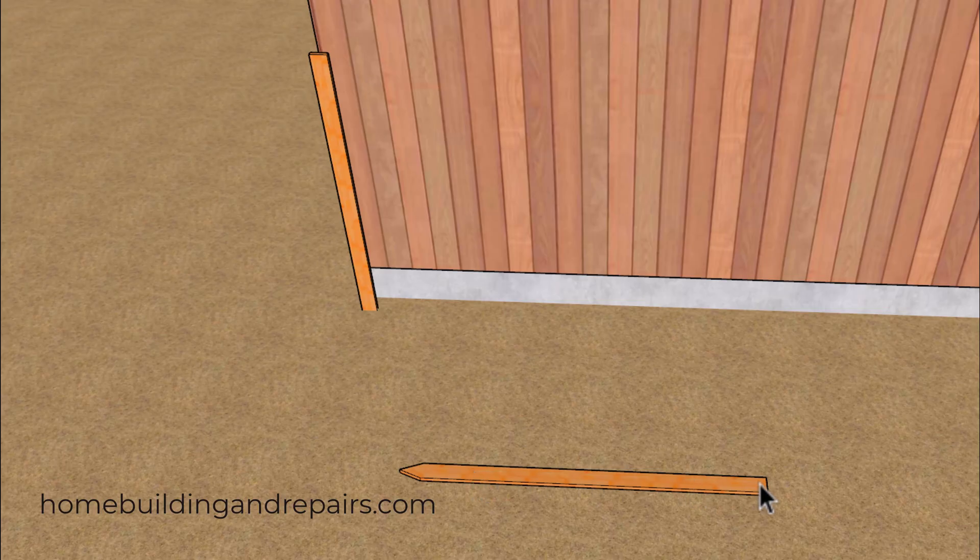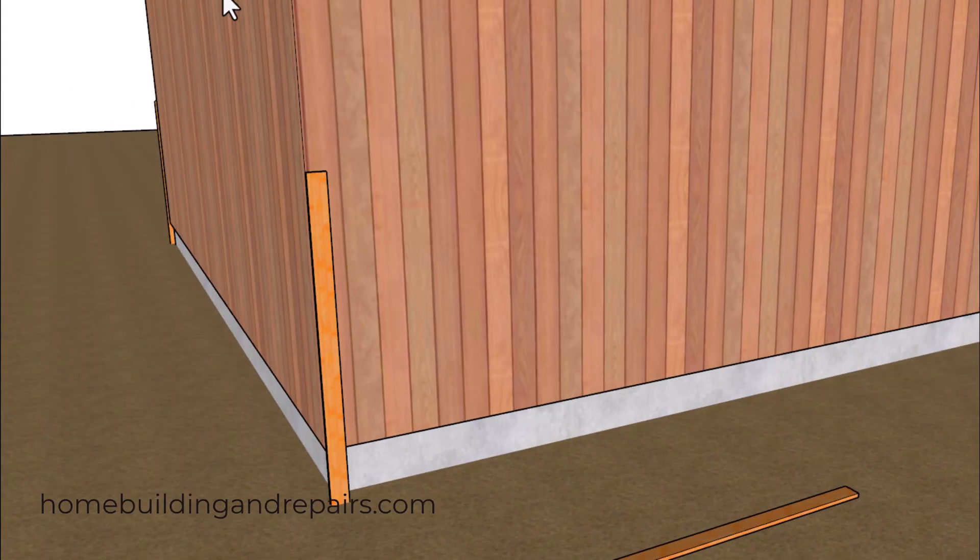Here I have a 5-foot long stake and you can simply drive it into the ground. You're probably not going to be able to drive it right next to the building because the footing usually protrudes out past the finished footing wall, and who knows how far it can be protruding out. Basically you're going to be using a stake as a reference, and if you need to, you can always install some braces.